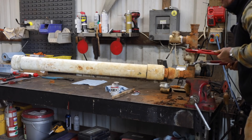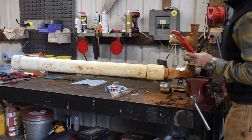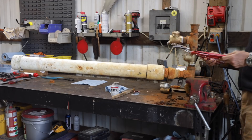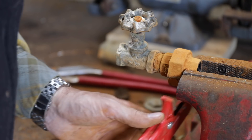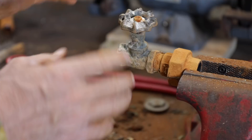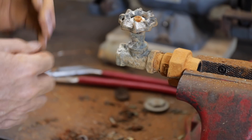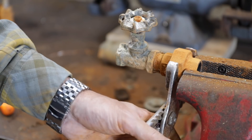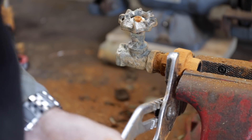Make sure we have everything in line there. You want this top check valve here to be vertical and in line with the pressure pipe, and this one here just needs to be up and down. This is a union here — if you have a long piece of pipe and you want to put something in the middle without spreading it, it's a flat face coupler on both ends. That way you can lift it out. That was my original idea, so I could take it out without changing all the lines.